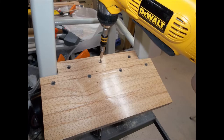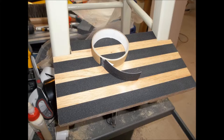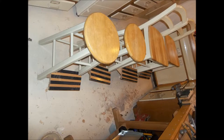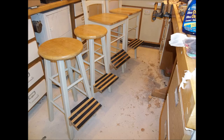I had to re-drill the metal hole here so it goes into the rung a little better. I use one-inch drywall screws in the back and two-inch in the front. This is a little veneer roller. That's how much tape I had left when I did all four of these — not very much left. Now I have two bar stools: a small one and a big one at 90 degrees, a big one at 30 degrees down, and a small one at 20 degrees down. I'm still debating what I like the most — it's just nice to be able to change your foot position. I think I like the 30-degree-down one best. The treading makes it so you don't slip off the footrest, and your feet are actually hitting the rest at 90 degrees. It's worked out pretty good.